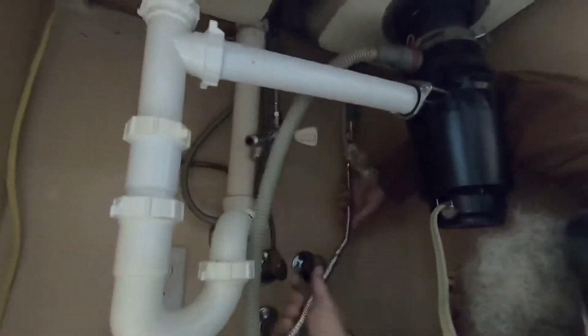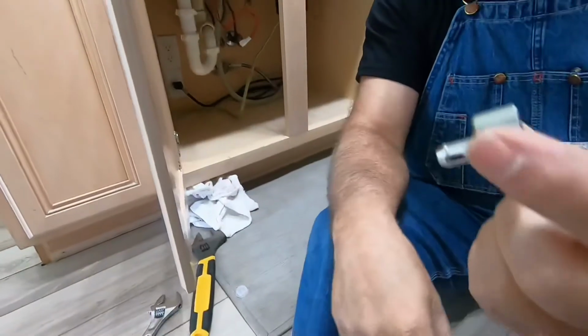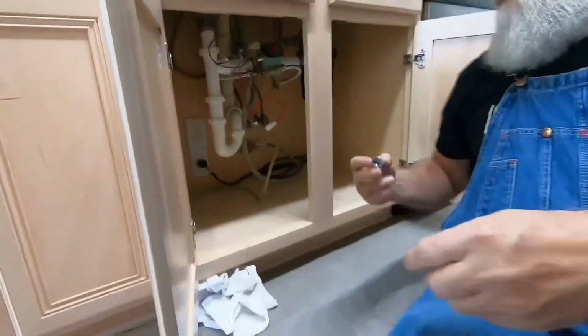Next, we're going to figure out how to arrange all of the hardware under the sink with all of the piping that we have going on. And for us, this was definitely one of the most difficult parts. Then we're going to take the knurling nut, and this is going to go right onto the water feeding port that your Kangen water is going to come out of.